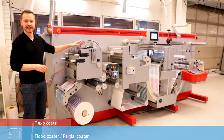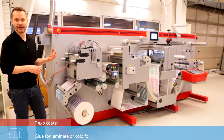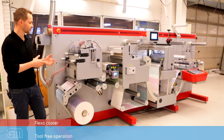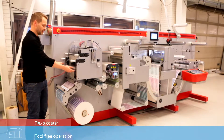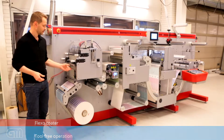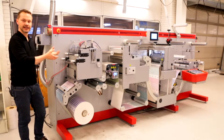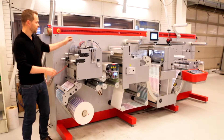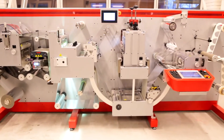Then we proceed into the flexo coater. The flexo coater can operate as a flood coater, a partial coater, or it can apply glue for a laminate. You can also apply glue for a cold foil as an example. The unit is tool free — you don't need any tools. You can change the tray just by flipping a button and you can pull the tray backwards, insert another tray, reload the tray and you're ready to go. The same goes for the tools. Once you open the station, you can easily take out the ductor, anilox and print roller. The impression depth can be adjusted with two fine scales here at the top of the station. So all in all, an easy to set flexo coater.